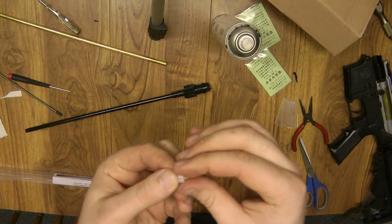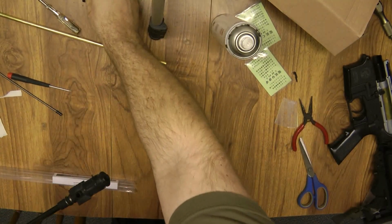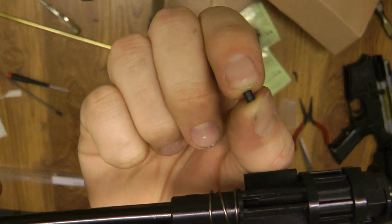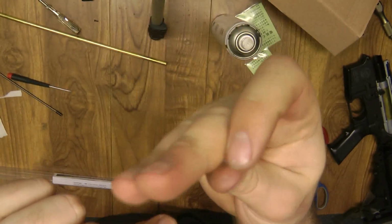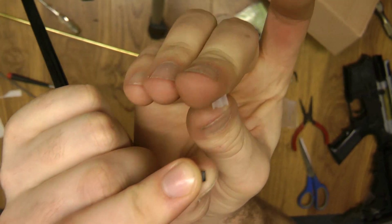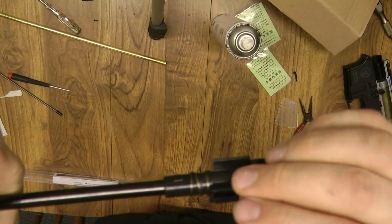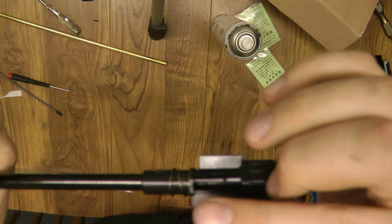The reason we use this one is because it's long and flat. So what we talked about here with the normal nub being short and coming down on a single point in the middle of the unit there on the arm, this one is flatter and longer, yet on the underside it's the same shape as the normal nub. So what it does is it comes down over the entire area in there. It pushes down slightly more, just ever so slightly more, for a longer distance.